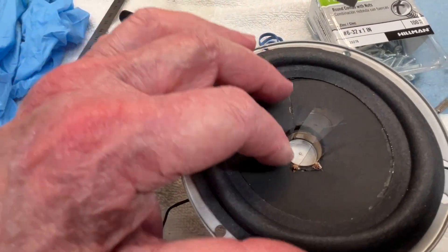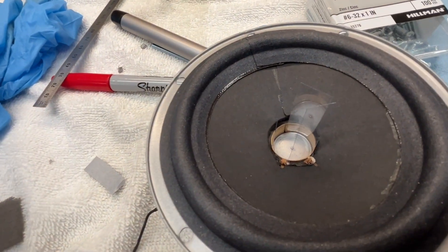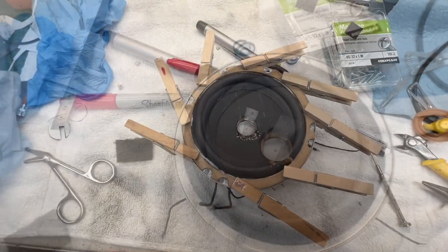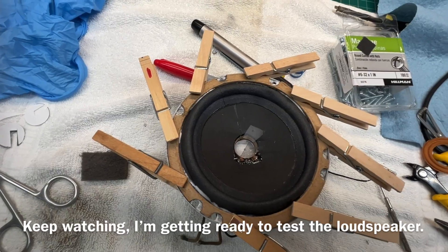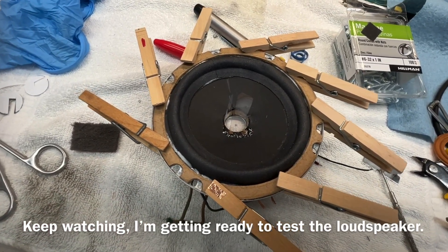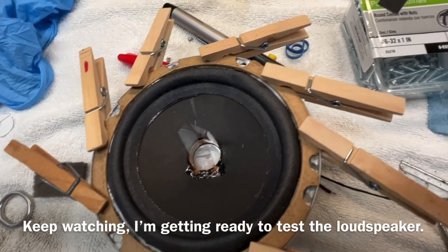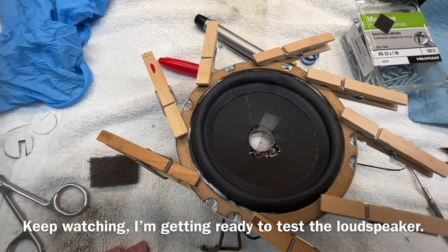Another dry fit — again, I don't have much voice coil protruding. I've got the leads off the voice coil itself. I'm going to mix up some epoxy and give it a good old try. Placing some Elmer's white glue around the perimeter where I'll attach the homemade cone, with just a little bit of weight to let it dry on the back side. I'm going to have to extend the voice coil leads just a bit. I used white glue around the surround back to the basket, and I'm not 100% confident I had enough voice coil to get the cone attached — so time will tell.